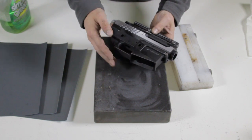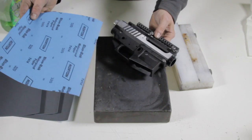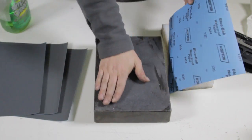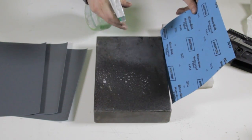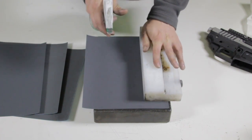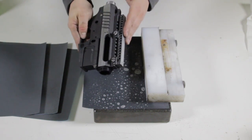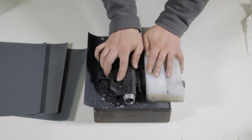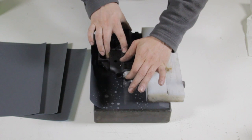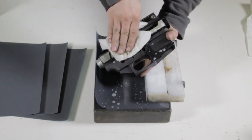Moving on to the hand polishing of the receiver set — normally the anodizing would also be removed from the lower receiver at this point, but for the sake of this demonstration, we've opted to hold off that step until later. Starting with 320 grit, we'll position our wet-dry sandpaper on top of a perfectly flat granite block with a spray of soapy water to help adhere the paper to the block. We'll then position our guide, spray down the paper with more soapy water, and position the receivers using a special in-house fixture to keep the parts in line with the guide. Holding the guide stable, the receivers are slid slowly back and forth to polish the flats and give consistent parallel lines. After several passes, we check the work, paying particular attention to where the receivers meet at the rear. Then we move up to gradually higher and higher grit paper until we reach the final finish of 600 grit.